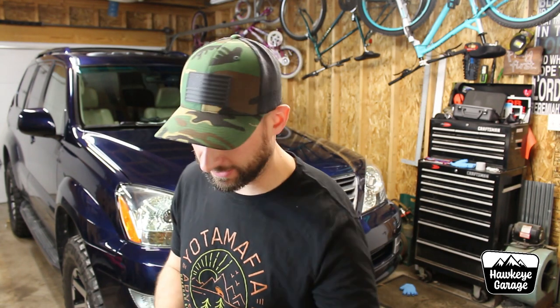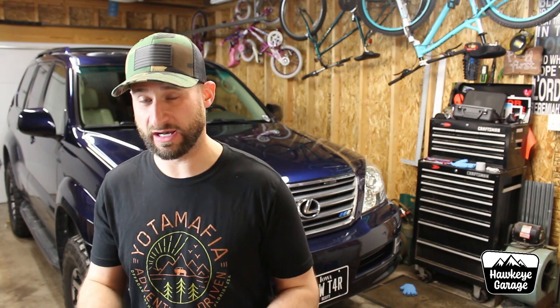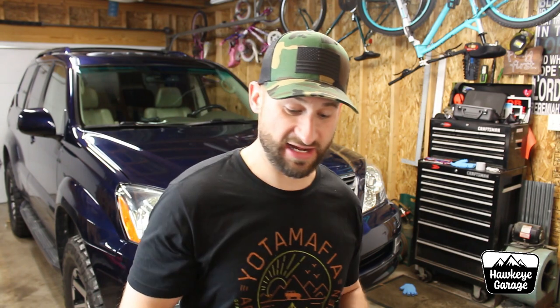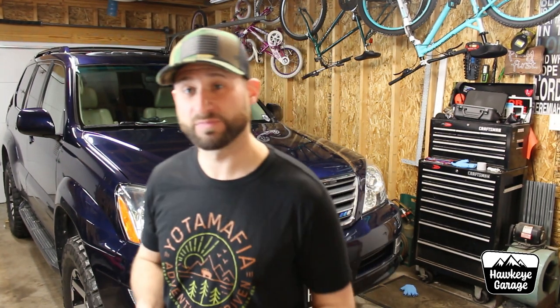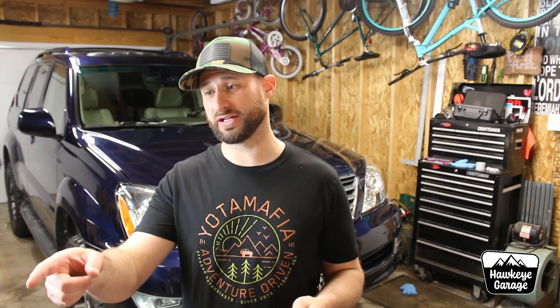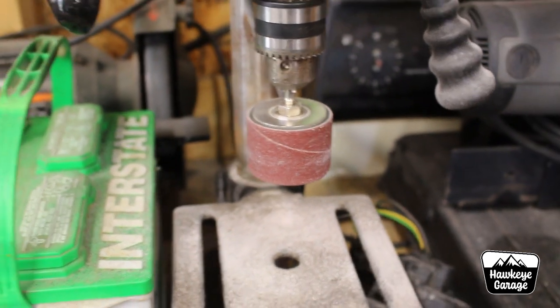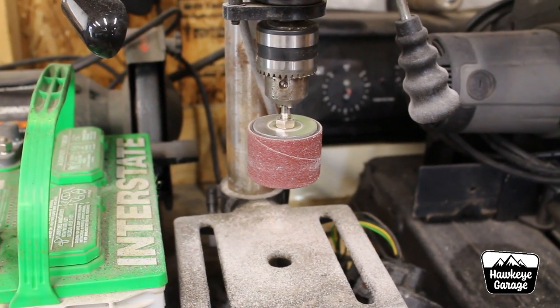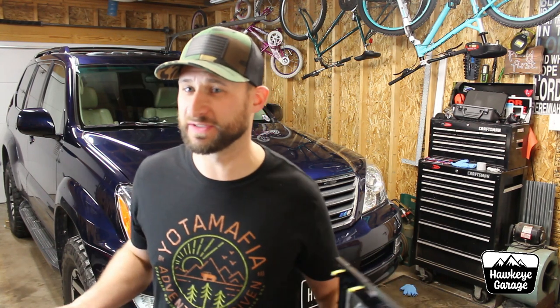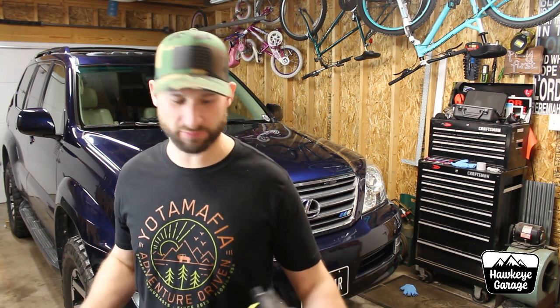If you guys are going to do it the way that I did it, all I did to cut the holes was a little side rotary cutting bit for my Dremel so you can plunge and then cut in a circle. And then I used the drum sanding disc with my Dremel, and then I got a bigger drum sander and put it on my drill press to just walk them out to the size that I needed.